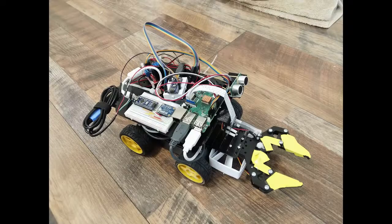Now I'll show the robot I've constructed. This robot has four wheels driven by four motors. I use a single L298N motor controller which only supports two channels, so the left and right wheels are wired together. The parallel gripper kit A from Servo City is used to pick up construction materials and has yellow tape to prevent the camera from seeing reflections on the black plastic.